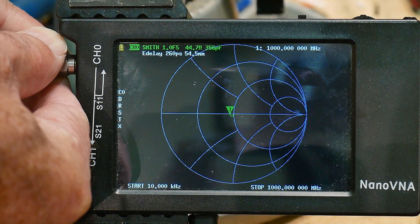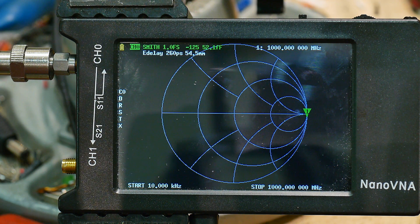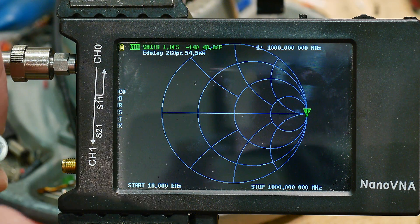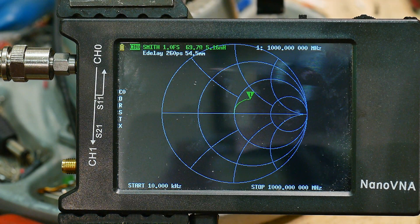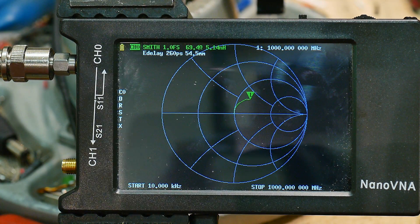Let's try another one. I've got a bunch of these — I've labeled them 50 ohms because I know that's what they are. Let me put one on there and — whoa — it has some problems at higher frequencies. At low frequencies it's 50 ohms, but at high frequencies it's not.